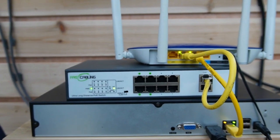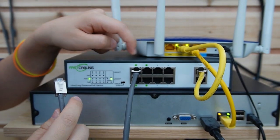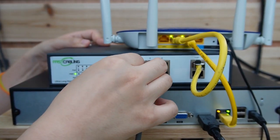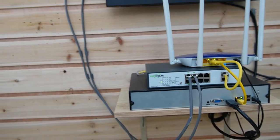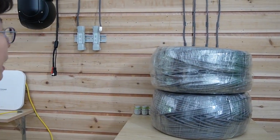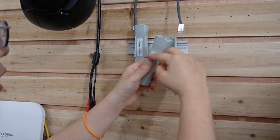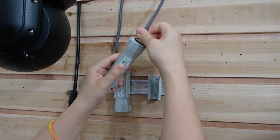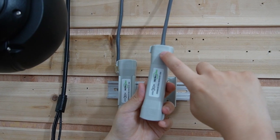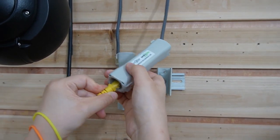Since we have two devices, I'm going to connect two of the long-range PoE ports. Remember, only ports one through four are the long-range ports, so make sure you plug into port number one to four. We have two piles of Ethernet cable here, and each pile is 300 meters — about 1,000 feet. Here at the edge, the PoE extender will help the edge devices boost data back to the main switch. Make sure you plug into the correct port — this is input port A, which we connect with the Ethernet cable, and the output port connects to the edge device.